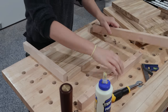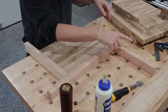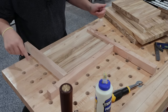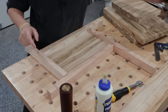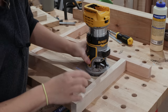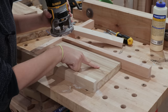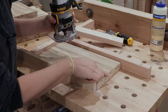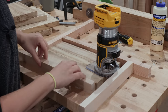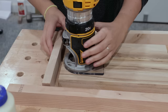The premise behind this is that we're going to make a fence that goes all the way around the board. It doesn't matter how long these pieces are because you can offset them so they fit around each other — they just need to be tall enough so that a router can run along the edge of them. If I just set it up like this the juice groove is going to be way too far from the edge of the board, so what I need to do is make a spacer so that these boards sit further back and the juice groove will be closer to the edge.